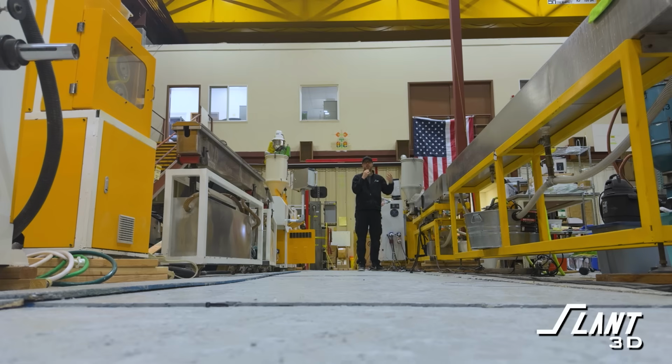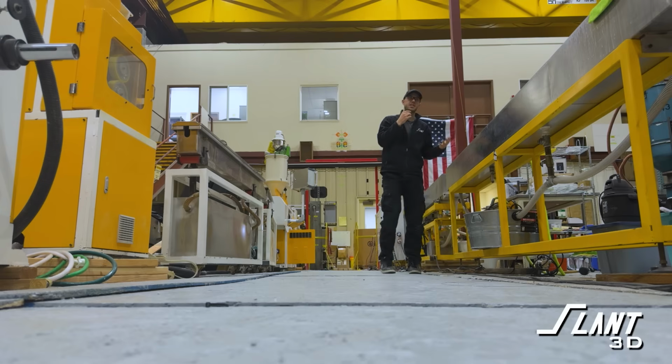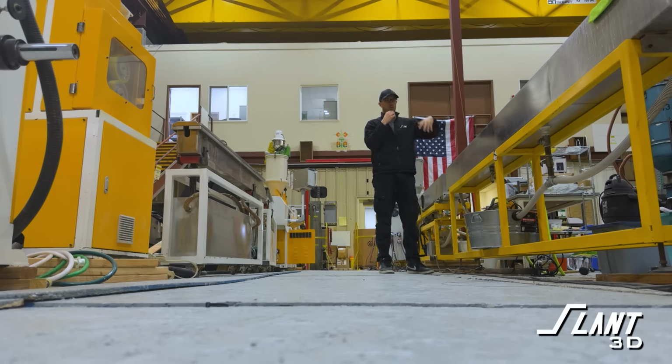So we just made a 3 kilogram spool right off the bat, so that people could get the cost savings of not having to buy 3 spools and buy the labor of 3 spools. We worked through the normal production process that we'd been using all the time of allowing the extrusion line to run 24/7. This is actually fairly easy because even though a lot of people will only operate for an 8-hour or maybe a 12-hour shift or so with normal extrusion, it can actually basically run overnight so long as you have some way of spooling it at the other end.